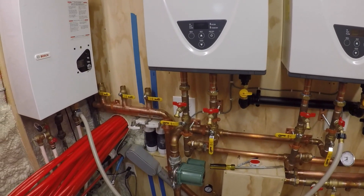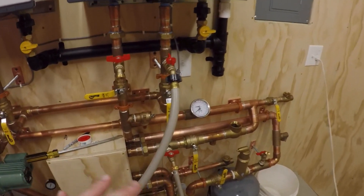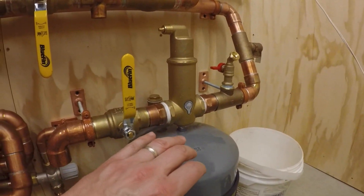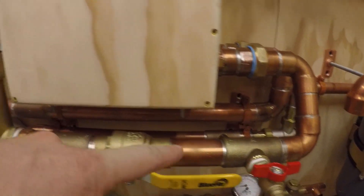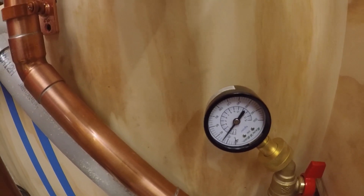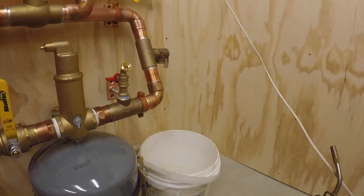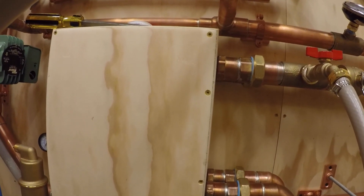Quick update here, Saturday the 30th. Where I left off was trying to get the connections solid for the heat exchanger, and I believe I've done that. I filled it with this off, cracked it to vent some air all the way through. It's got just under 30 pounds of pressure on it now. The pressure relief valve is dripping a little bit, but that's probably because I'm so close to 30 pounds — it's only a 30-pound relief valve, and that side's only going to have 15 in it anyway.